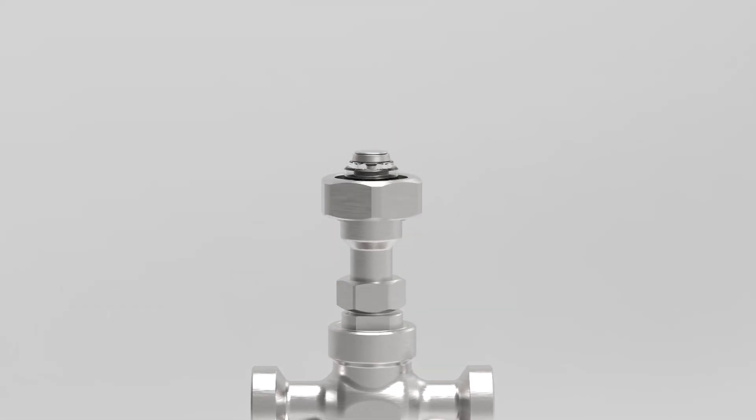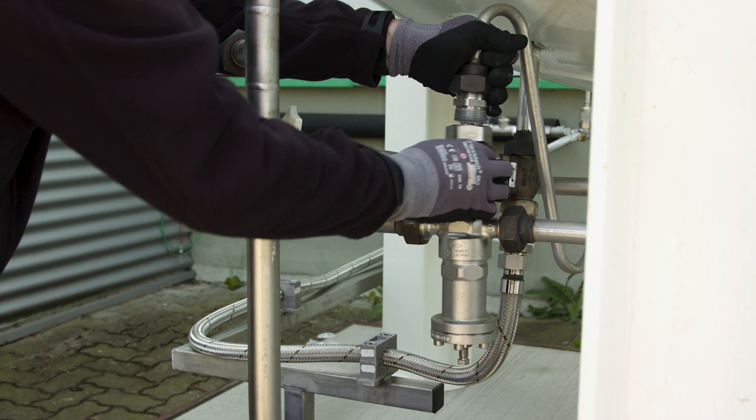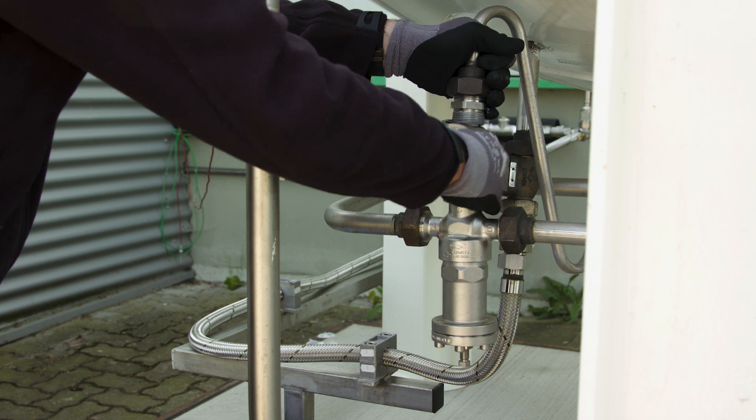The caged medium can escape via relief holes. The upper and lower body can now be separated. The upper line is closed by the T118. The repair work on the regulator or the check unit can now be carried out.